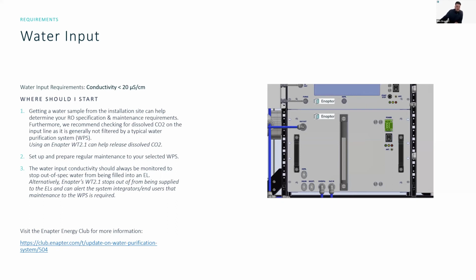When you are doing this, it's very important to make sure that you don't have a wrongly sized water trap in the purge, because what can happen then is that hydrogen actually goes through the water trap into the drain, and then you have hydrogen in your drain, and we don't know where that goes. So in general, it's very important to keep these two separated.